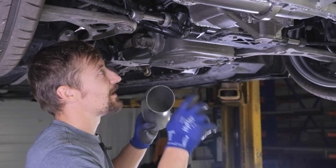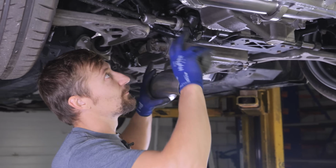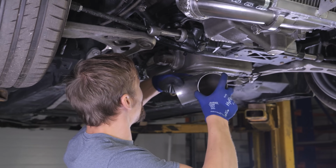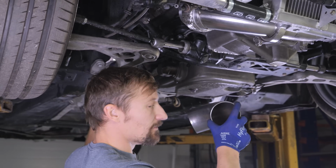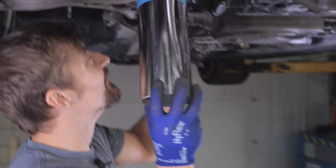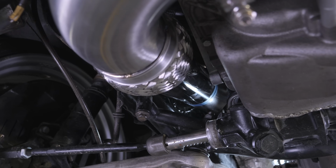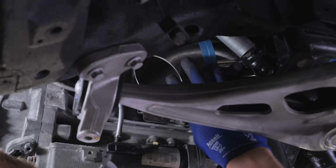Again, sometimes you just get a bit of an idea, you can kind of see it before you make it, and I've done a lot of these kinds of things, so hopefully I can just straight line that, 45, bring it back out, away from the engine block again, back out towards the gearbox. Right, so I've got that 200mm long piece with the 45 on the end, I've got the other 45, and I can more or less straight line that through there.